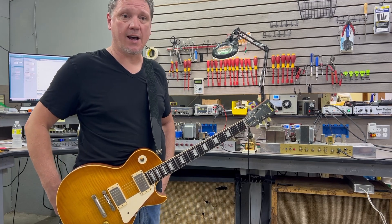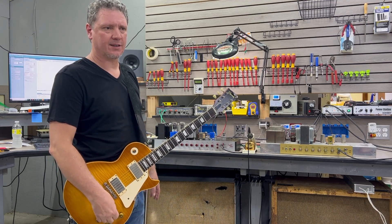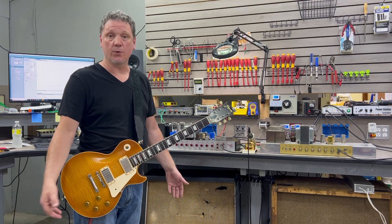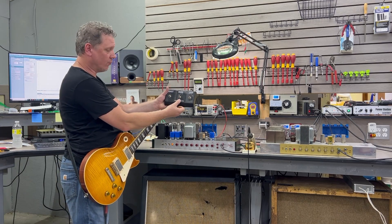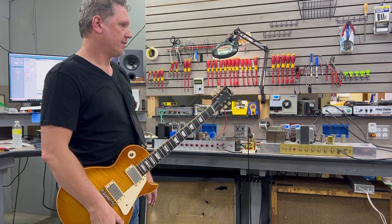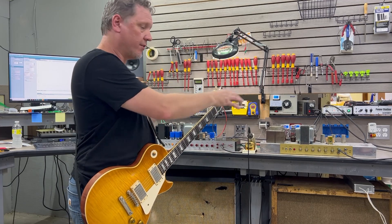It took a long time, but now the SuperPlex Mark II is coming to be. This has the same feature set for the most part as the original SuperPlex, but I started over with the same design intent and refined things along the way. What you have now is an amp with two different gain levels — two modes. Mode 1, when the LED is off, is the mode with less gain. In this case, mode 1 is a recreation of the stock JTM 45-100: the gain levels, the way the gain pot works, the EQ, the frequency balance, the harmonics — it's a stock 45-100.